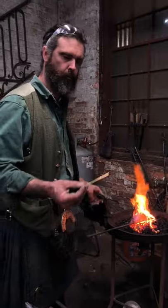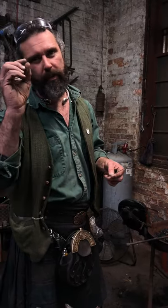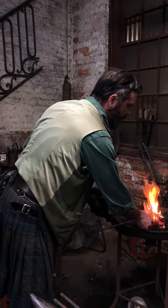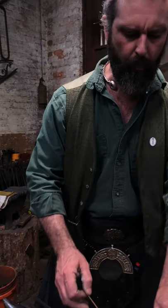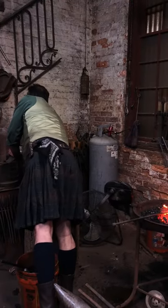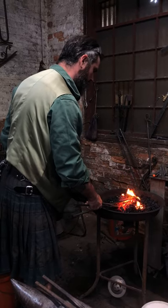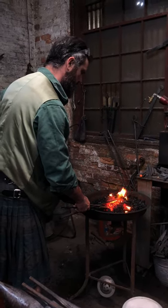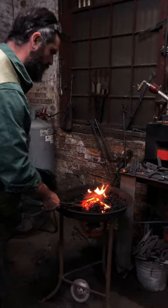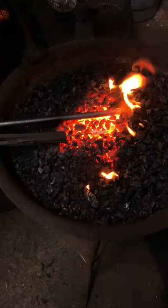You're using brass rod? Yeah, this is actually brazing rod rather than just brass rod — there's an alloy difference. This is just industrial brazing rod. You can warm this just a touch to get it to pick up. You see that one there has come up to temperature quite nicely. Because of the environment that it's been in, it's actually fairly well protected.